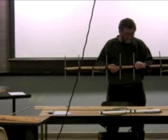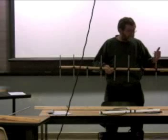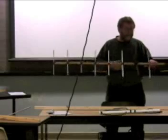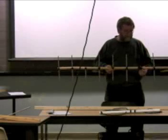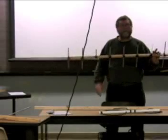Now, you can make better antennas than that. There's equations, there's simulation software and what have you that will make a more precise antenna that performs a little better. But if you just want to do something quick and dirty, cheap, you can just throw one together, and that's what I did. I just spaced these at a quarter wavelength, 5% drop in length, 5% increase here, and used this little J-match technique that Kent developed, and this works quite well enough.